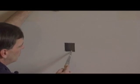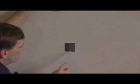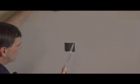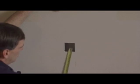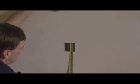First, you need to cut out the drywall patch with your keyhole saw. It's roughly square, it doesn't have to be perfect. Take your tape measure, measure both directions of your patch, and you're going to cut your patch slightly smaller than the opening.